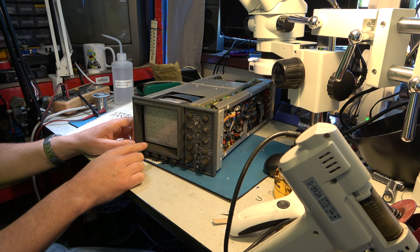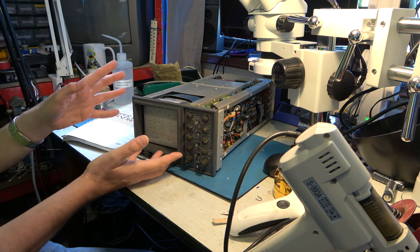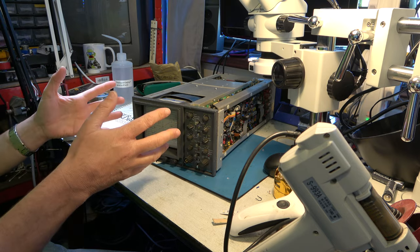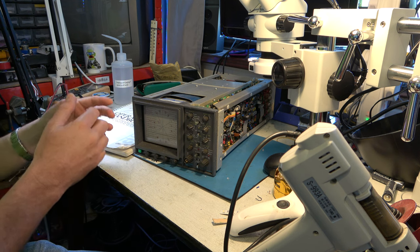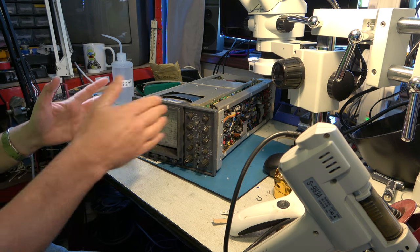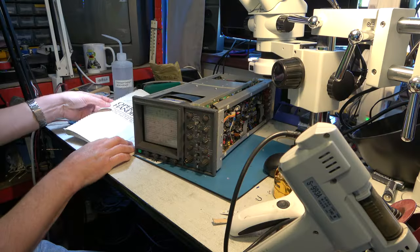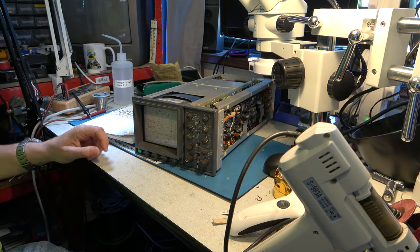You can see it looks a little bit like an oscilloscope, but it puts points on here which show you the intensity and phase of color signals, especially if you put on a color bar signal. It's very good for lining up the whole chain. They're used not only on the camera side when you're making sure that the lighting and color is correct on captured pictures, but also in the whole transmission chain — your video recorders, for example. I have a one-inch C-format video recorder and you certainly need a vectorscope to set that up. It would have been great if I'd been able to fix this wonderful piece of equipment, but no.